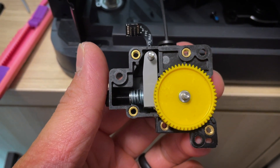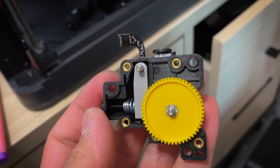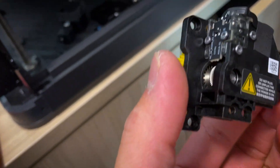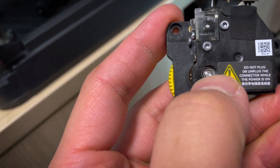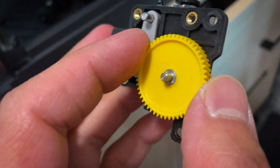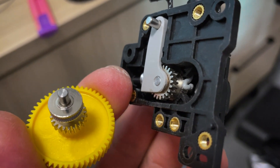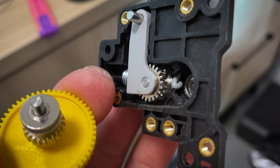After playing around with this for a little bit, it looks like I actually need to pull this yellow gear out, which is attached to the pin right over in the center here in this bearing. That whole pin should come out with the yellow piece and then we should have the clog revealed. Okay, so I pull it out and as you can see, there's the TPU stuck in there. I'm going to get that out and we should have a clear extruder.